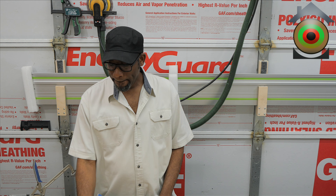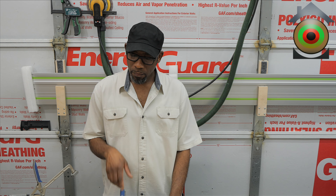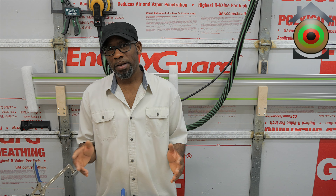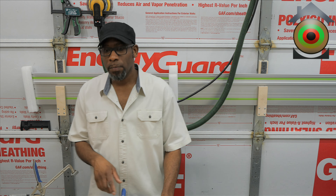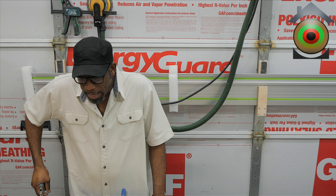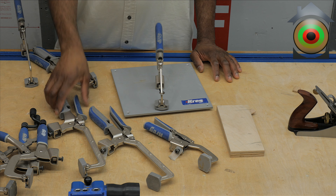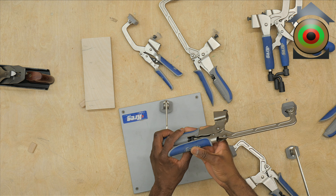These clamps have been a hit and a miss, and sometimes can be very frustrating to use. Going back to the joinery itself, even with a lot of clamping pressure, it still wants to creep. I have the portable one, which is the original I've owned for years, and a couple of years ago I bought the Foreman, which decreases production time but has the same creep problem. I do intend to try a Castle product that produces a lower angle — they claim that eliminates or virtually eliminates creep problems. We'll see; I'm going to try that and review it one day on the channel.